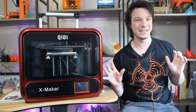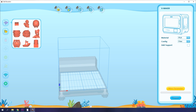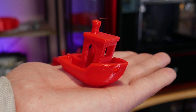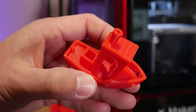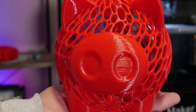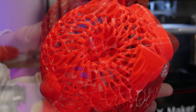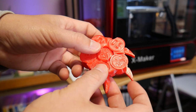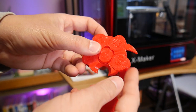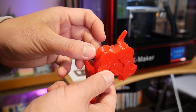While somewhat cringy, the educational slicer is easy to use and understand. I printed the Benchy and a piggy bank at 0.15mm layer heights and the results are really quite nice in PLA, though cooling could be a little bit of an issue for some smaller details — there's some blobbing in areas where the nozzle had to move between points and the filament didn't have enough time to cool. Clearances down to 0.3mm gaps before parts welded, and those tiny blobs from weak cooling seem to be the reason.